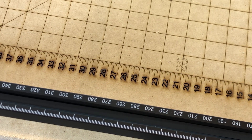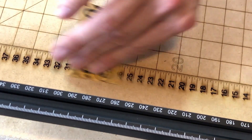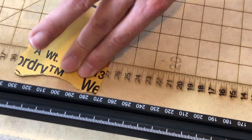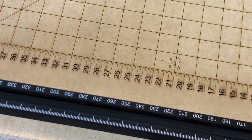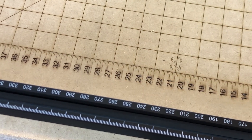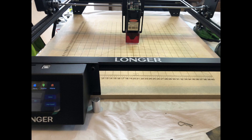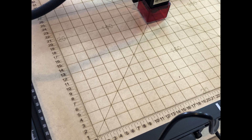You could have used some blue painter's tape to help alleviate some of this charring, but instead I'm choosing to use some 320 grit sandpaper. You could just gently go over it and you can already see some of it going away — we're just removing the charring. I'm just going over it and then using a brush, and look how nice and clean it looks now. I think this waste board came out rather nice, and it's great to have it for just orienting your part. The accuracy is pretty darn good. I suggest everyone should have a waste board of some type underneath their laser.